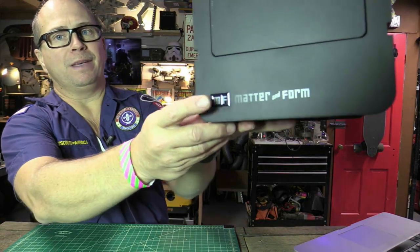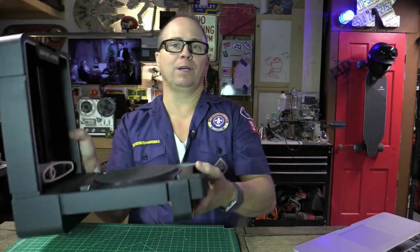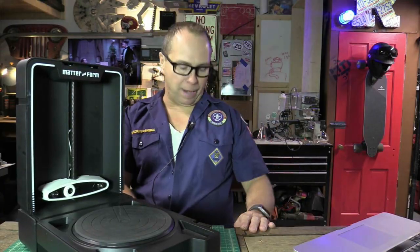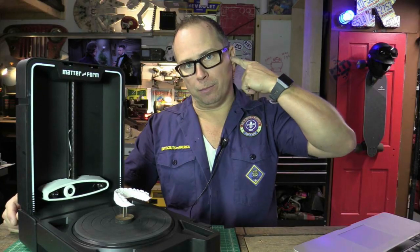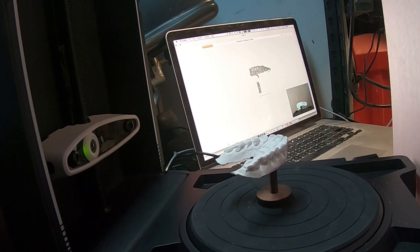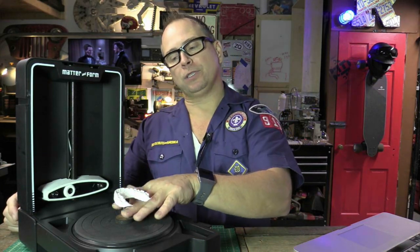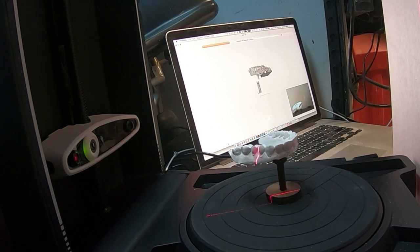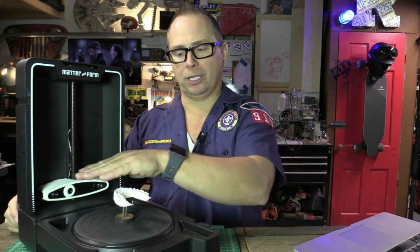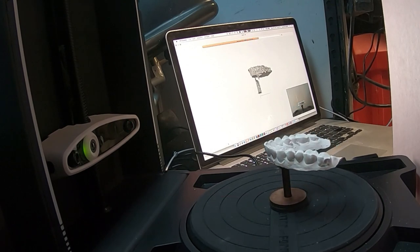The Matter and Form button on the back has this really cool glowing light — I really enjoyed those little touches they made. The first scan I made was of course these 3D teeth. One of my dream projects is in-ear monitors — scanning the actual ear impression, the silicone mold inside your ear. I also found that if you position something in different areas, you get those structured light rays coming from the projector. There are two lights that hit from the side, so it's important not to have dark areas or dark cavities.